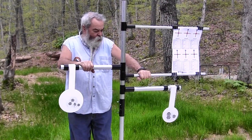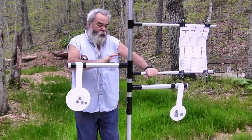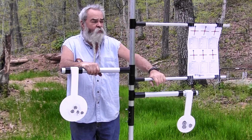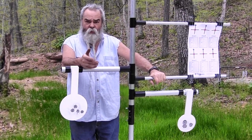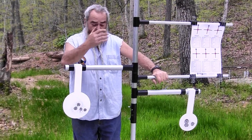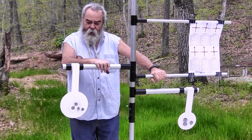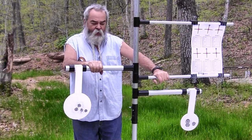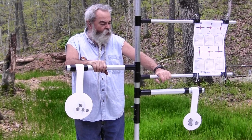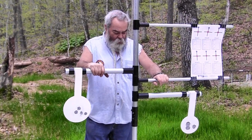The design of this thing is pretty good. A couple of things I need to see done differently: chasing those threads at the factory. I torqued the head off one of these thumb screws because you're having to use pliers on it — they're thumb screws, they're not supposed to need pliers. If you've got to use a wrench on it, they should have a hex head on it. But you can replace those thumb screws, and these pipes — if you hit them and ding them up — they're just standard EMT conduit. Cheap and plentiful at Lowe's, Home Depot, any hardware store.